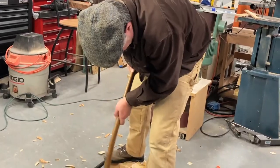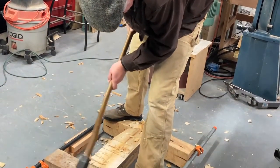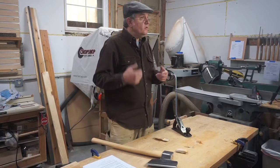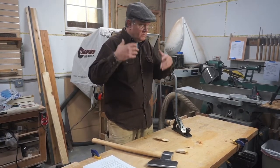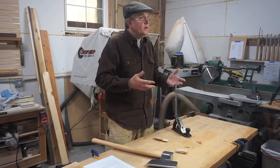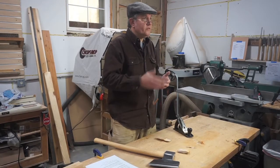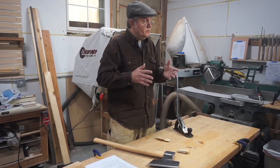When I approach a new challenge in woodworking, as I hope you will now, I tend to think first, well, what would be the coarse step? And where do I go from there? And what's the last tool? What's my fine step that I'm going to use? Cuts can be made with a sequence of steps using either hand or power tools. Power tool work often seeks to go from the initial state of the wood to the final workpiece in just one step. That's done via very carefully setting up the tool, first and last pass, to make a very precise cut just where you want it with a nice smooth surface.